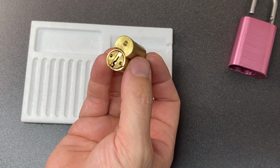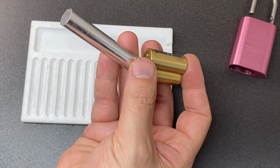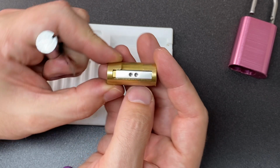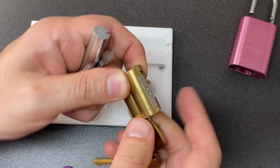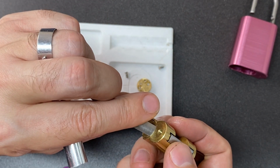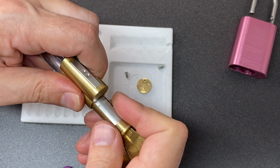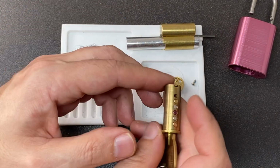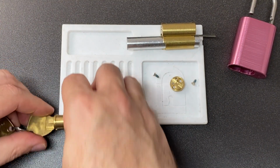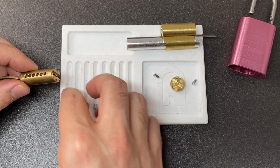It looks like a quarter inch follower as needed. Something like that. That's good. Let's see if I've got a shim. I should have a big pile of shims. This one's a bit broken, but it should be fine. We could probably take the pins out from the top as well, but I prefer to do it this way. Pop that in, all the way. There we go, and slide it out. Nice. Ooh, it's very new. Let's drop these, 1, 2, 3, 4, 5. There we go. Those are the key pins.